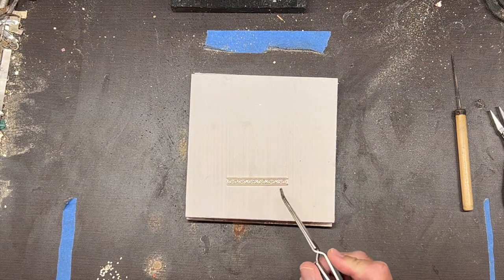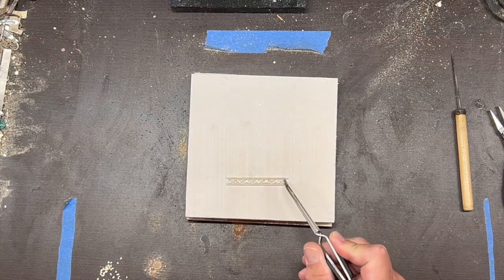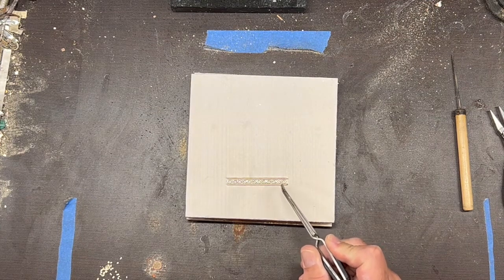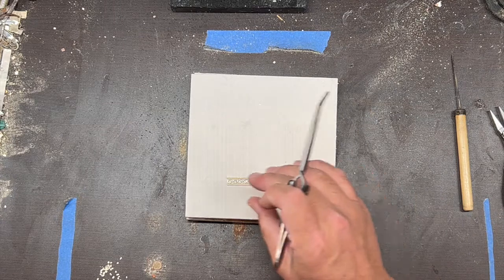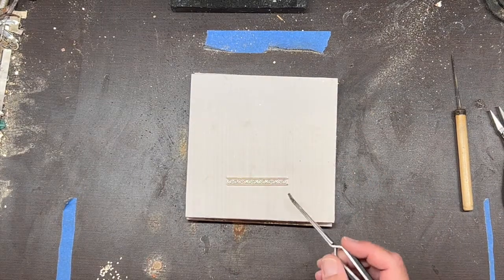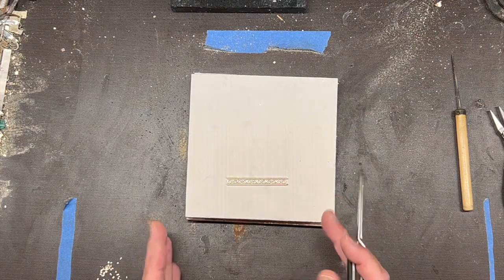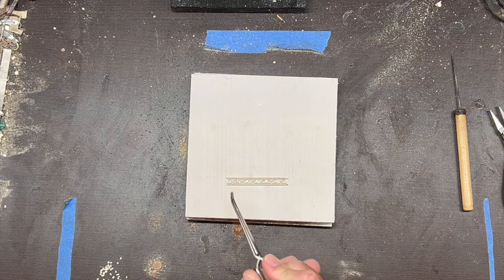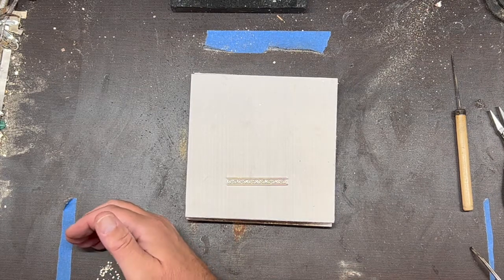So there's a couple ways you can deal with it. One, you could do it in stages with three or four pieces of solder at a time. Get those ones to flow and stick, and then add more, and it'll stabilize the whole thing, and that's one way to do it. But if you're going to do pick soldering, you can take what used to take me, when I first started, maybe an hour and a half to do, because I was precisely placing these things, and turn it into something like 10 minutes. I don't know, we'll see. I'll do an actual time video here, and we can look and see how long it takes.